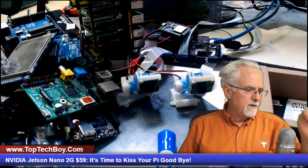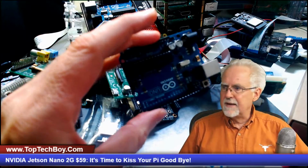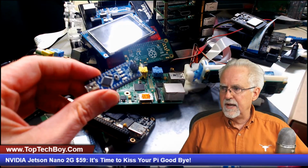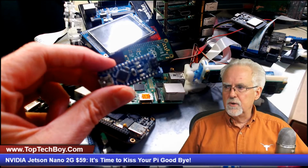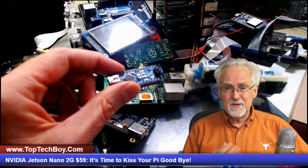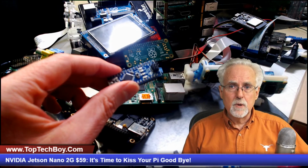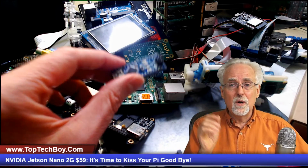But if you look over here, there is a huge number of different Arduinos in different configurations. This is the old standby, the Arduino Uno. But I want to down select to just one Arduino, and what I like to use is the Arduino Nano. The reason is that it is smaller, and also more natural. If you want to put it in a breadboard, it pops right in, and you can use neat jumper wires, so you can get something more of a prototype than a complete benchtop demo. Because this has the male pins, it's easier to plug into a breadboard, and then you can very easily go the next step, which is to design your own little green PC board where the thing is soldered in.